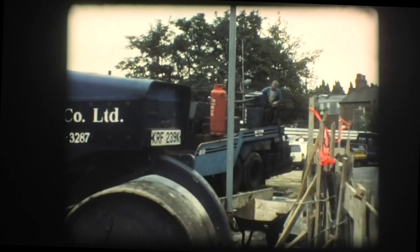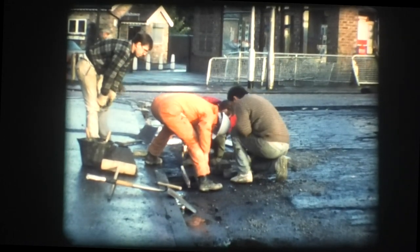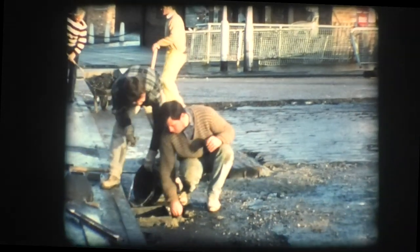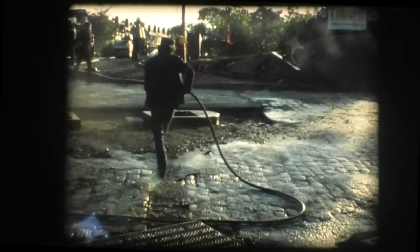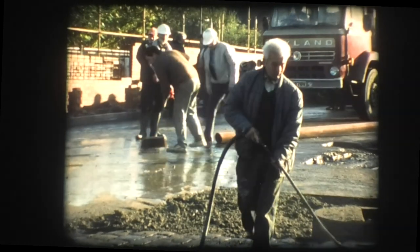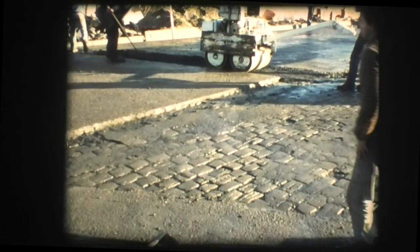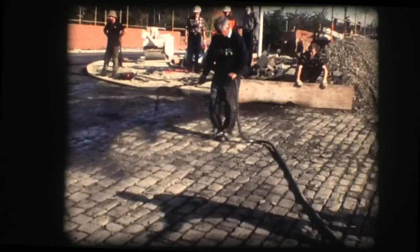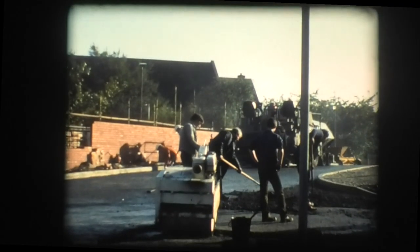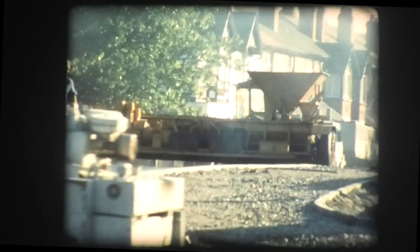While all the blacktop over the main deck is applied by mechanical means, that over the side street approaches requires manual application due to the irregularities of the surface in shape and depth, and to ensure an overall level finish. Manholes and gullies have to be raised, and compressed air and water sprayed to clear the stone sets of loose material, followed by a spray-on tack coat of bitumen emulsion to the clean sets to ensure adhesion to the main layer of asphalt. Awkward corners are filled in and rolled before the paver can be brought in to apply the final layer.